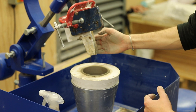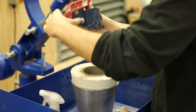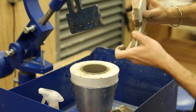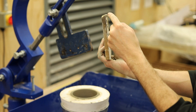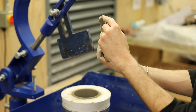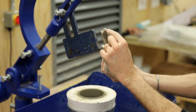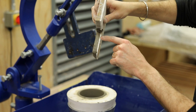There's a perspex front to this tool and an MDF back. The perspex front does the finishing — the final cut of the form. The MDF almost funnels the clay into the cavity, so it takes the brunt of the clay and the brunt of the wearing. You can see in the profile of this tool that there's a chamfer on the MDF and that really allows the clay to be forced into a thinner and thinner section. By the time it hits the perspex it just finishes and creates that final surface finish. If you get it right, your tool should last quite a long time because the perspex doesn't really get worn down — the MDF takes the brunt of the pressure.